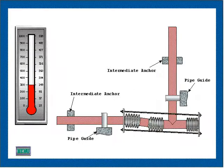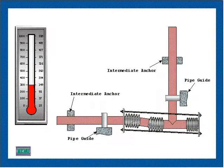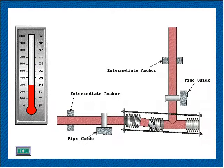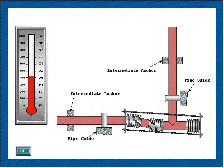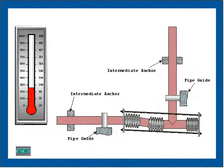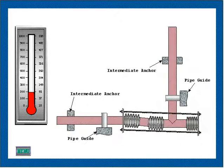In some cases, the pressure for the balancing end of the expansion joint has been introduced from a separate pressure source, but this is considered somewhat hazardous. A control failure, or even a slow control response, may result in a partial or full pressure loading being imposed upon the piping or equipment, thus overcoming the initial reason for using the pressure-balanced expansion joint.